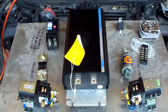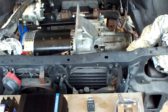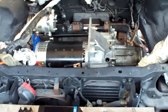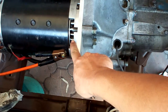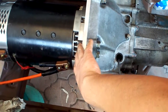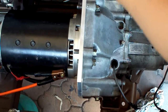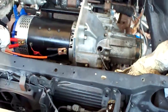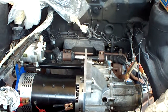So I am just planning it out, because of what I can see from here. This is my initial planning, to have the board directly on top of the motor. The natural flow is, this is the fan, so the fan will blow air towards this plate, and cold air will constantly circulate above here. If I mount the controller just above, in this area here, I don't need any cooling fan, because naturally the motor fan makes the air circulate, so it's no problem.